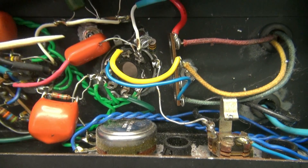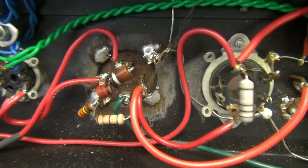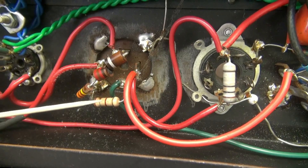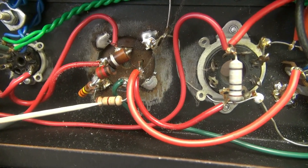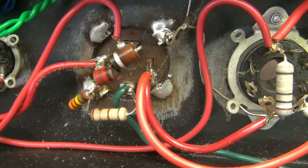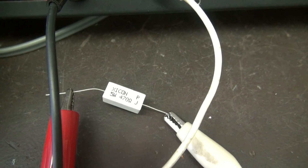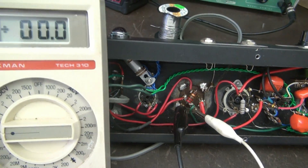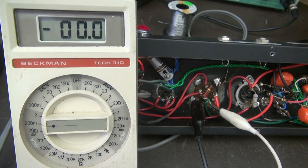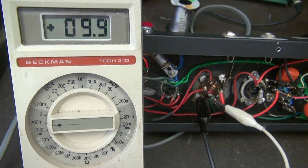The new 6V6 socket has been successfully installed. Now we have to go over to the power supply, get rid of old Smokey the resistor. This was the original bias resistor for the 6BQ5, which is going to be way too small of a value for the 6V6, so we're going to pull that too. For the bias check, I installed a 470 ohm, which is kind of the textbook 6V6 resistor. Plugging her in, watching the current — hopefully it's somewhere around 35 to 40 milliamps.